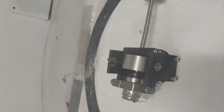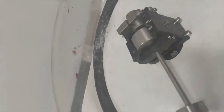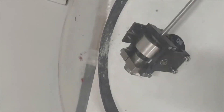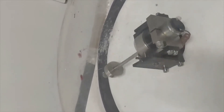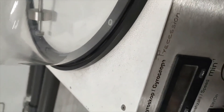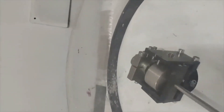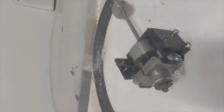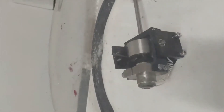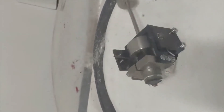The rotor is rotating, but the system is currently unbalanced — the pointer is not in the center at the white mark. We will now increase the precession speed such that while rotating, the system gets balanced, meaning this pointer will come to the white mark and rotate in a balanced condition.